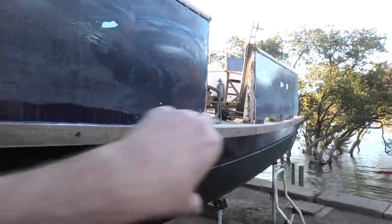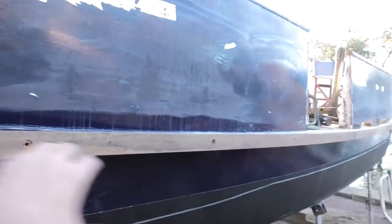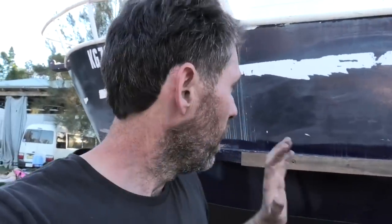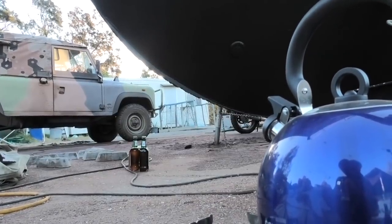What I'll do is take it off, do all the oiling, reattach it at the front so we've got the leverage to bend it round, and then hopefully when we get to the end it'll already have that curve locked into the memory of the grain and it should go back on just fine. I'll get some water on the front here to make it a bit more supple and we'll try that over the next couple of days. The kettle has started to boil so I'll go tip it all over the cloths. I'll grab some plastic tomorrow too so I can wrap it up and stop it evaporating and drying out.